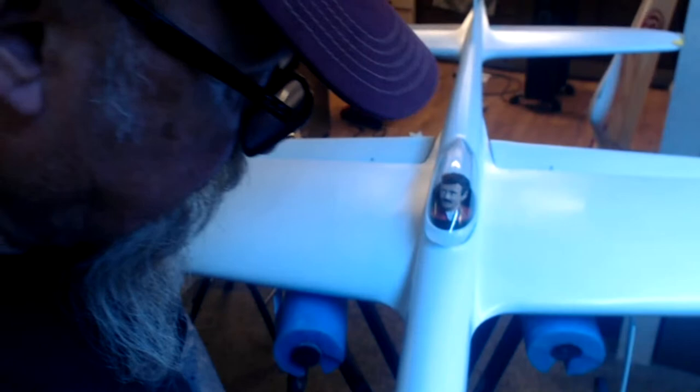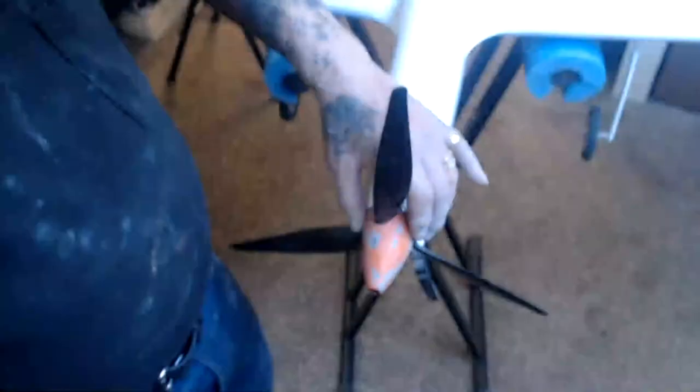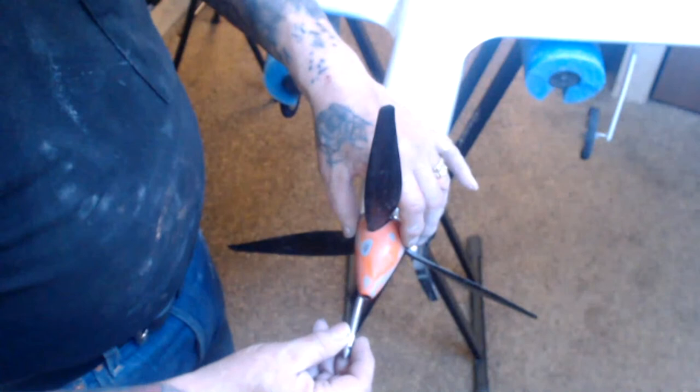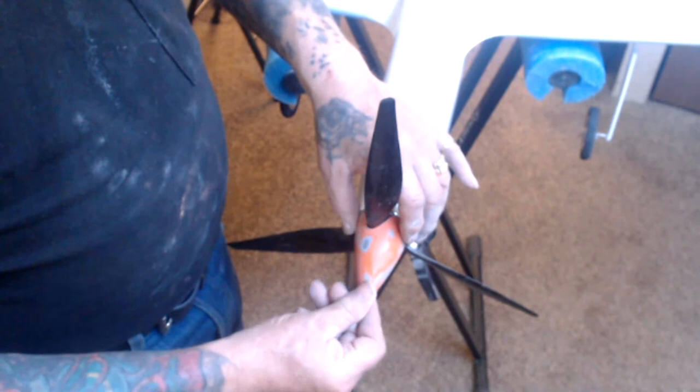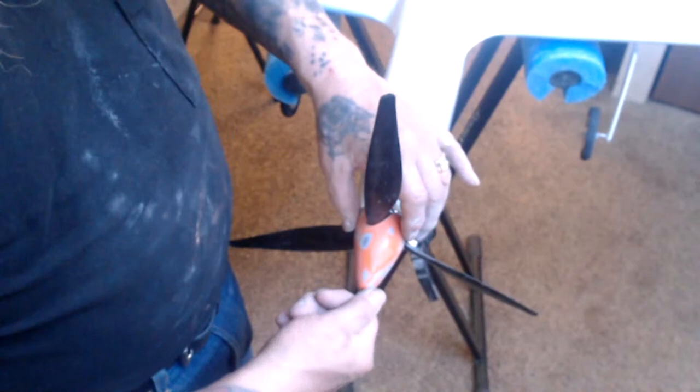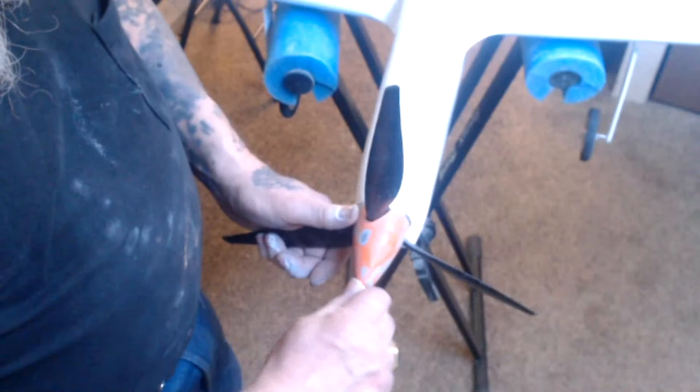The hardest thing about these spinners is indexing them. They just don't want to get onto the back plate very well. That's what I was doing today, grinding. Now we made these ends. This is not a Medusa end. This is so much better. It's about 1,000 times better. It holds the spinner true on there so it doesn't walk. Those other stupid things screwed right onto the prop shaft. It was terrible. So this uses a Randy Smith style prop nut so you can get your prop tight.